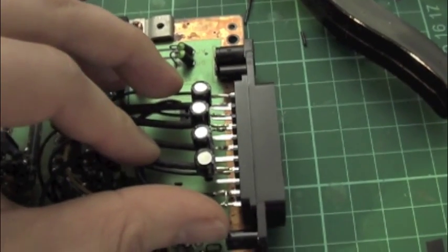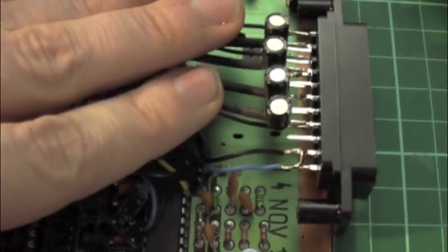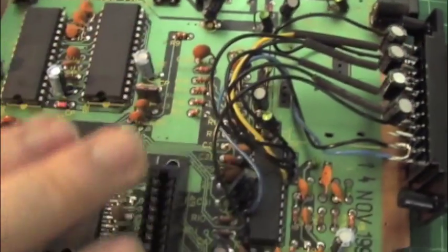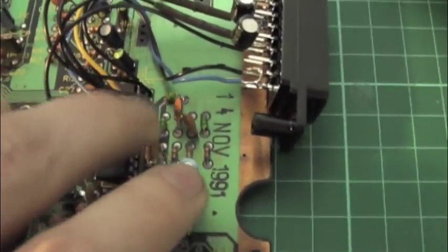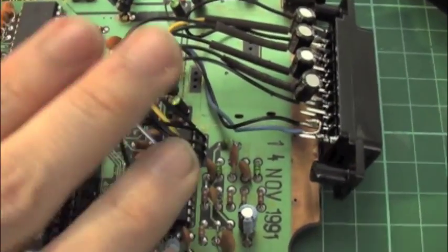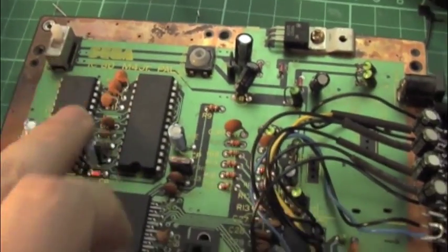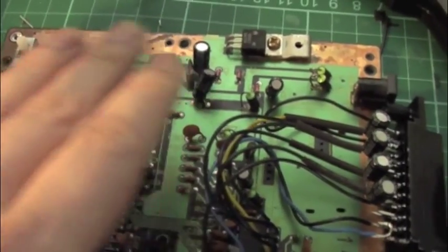here next to the power supply, and there's loads of space at the back for the wires and things, because I've removed the RF, and then obviously it goes to the appropriate RGB on the chips with the composite and the sound and everything. So all in all, quite a tidy mod. I'm still deciding whether I'm going to put an LED on the power switch, but that's a separate thing altogether.